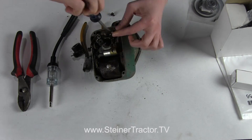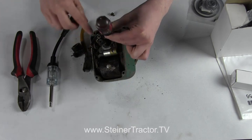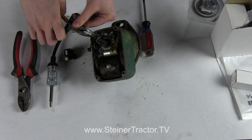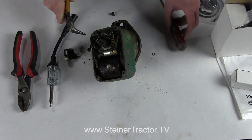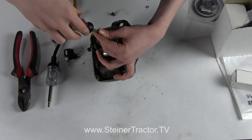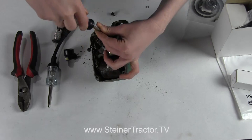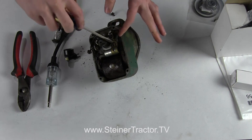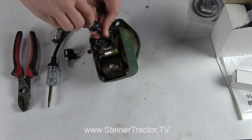I can see a little bit of corrosion in the points right there at the tip. We'll also take this little pin off the end and carefully pull that out with some pliers — save that washer and don't lose it. We can also take these two screws out which will take our condenser out as well. That will be our disassembly for this portion of the magneto.